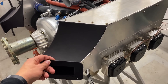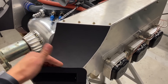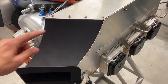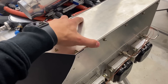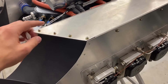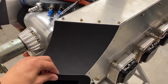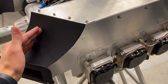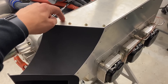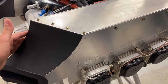Another great example of careful material selection can be seen in these cooling inlets on the engine. These would be tempting to make from carbon fiber since they have a complicated shape, but these inlets interface with an aluminum air box that goes over the cylinders — if this were carbon fiber you could introduce galvanic corrosion between the inlet and the air box. Instead, we made these inlets from nylon that has been 3D printed using an SLS process. Nylon is non-conductive, which essentially eliminates any potential for galvanic corrosion with the aluminum air box.